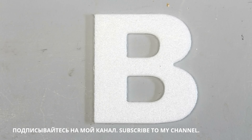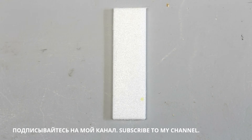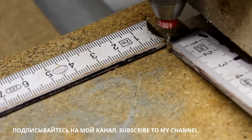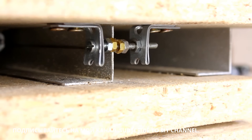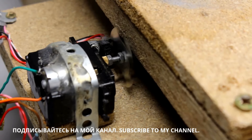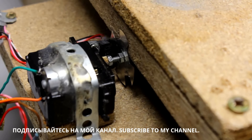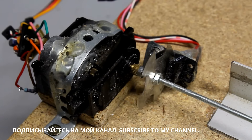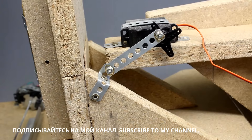The machine is meant to be an educational tool for learning how to do computer numerical control — it's not a production tool. You have to go to the starting point manually, and there are no switches detecting the endpoints of movement. You can adjust many software parameters, which means many things might go wrong. If you enjoy trying new things out and are willing to spend a weekend, you can get a working CNC machine for just a few bucks — and you'll get the knowledge for free.